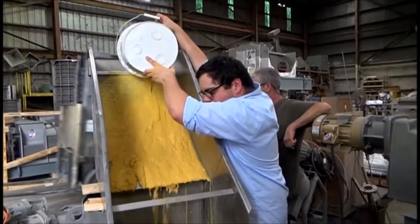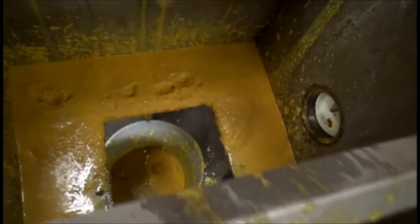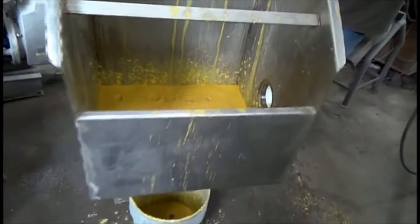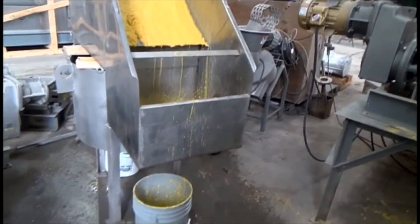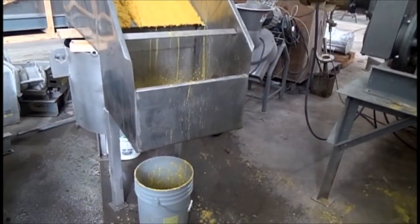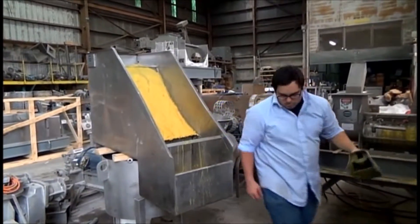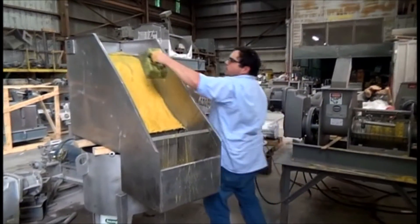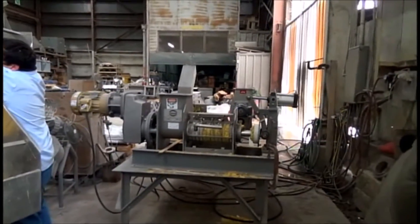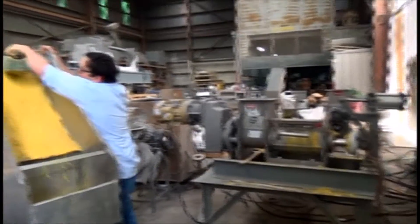Normally in a paper mill we use 60 inches of screen. This little screen is designed with a hole here so it bolts directly onto a screw press — short height, easy transition, inexpensive for minor industrial applications. What we're going to try and do here is replicate the performance of a centrifuge decanter. If we can make it as dry as a decanter, you're far better off using a screw press, because it has much less wear, power, and a very small motor compared to a decanter.